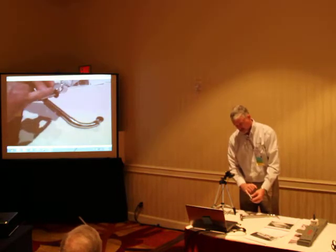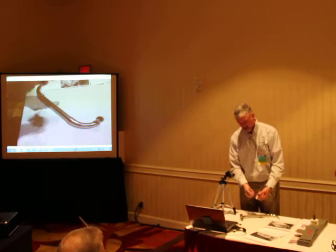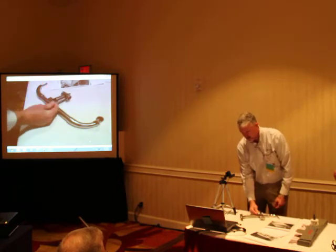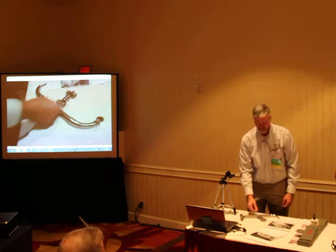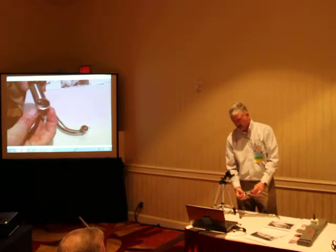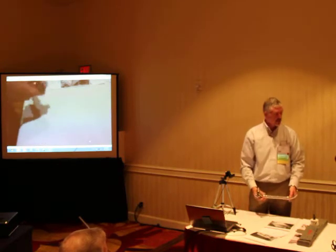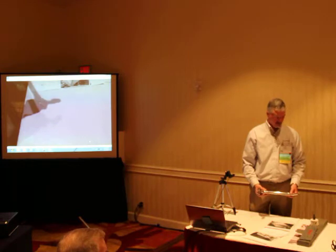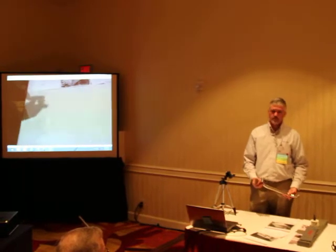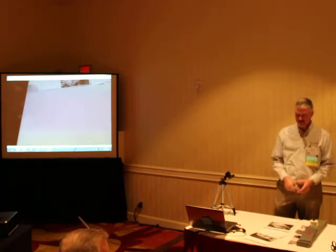This particular fabricator took a piece of stainless steel all thread, bent a 90-degree leg in it, put it through the hole, and then just put a finished acorn nut on the other side. Makes a nice little standoff that goes in the center of that grab rail. You can kind of see how the all thread is bent inside of it. You'll get an idea when you come up. And I think he said he gets the little black stainless pieces from Pascal.